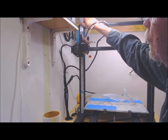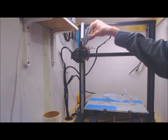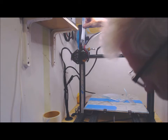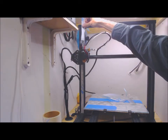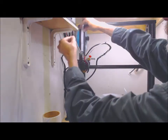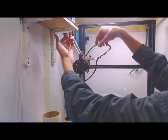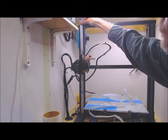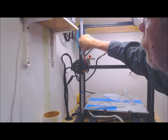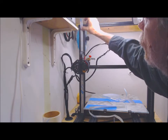You can't go any further, so now we need to lower the gantry. You can bend some backing paper over the edge or whatever, come back, hold the thing together, and continue lowering the gantry until you've got enough clearance to pull the rest of the backing paper away and rub the top half of the decal down without the gantry being in the way any longer. Again, try to keep the decal centered on the 40-20 rail. It will extend beyond the top of the entire frame. Don't worry about that because we can go ahead and cut it later.